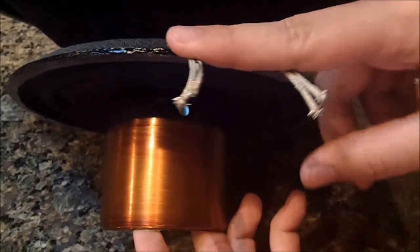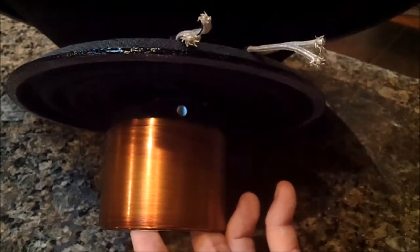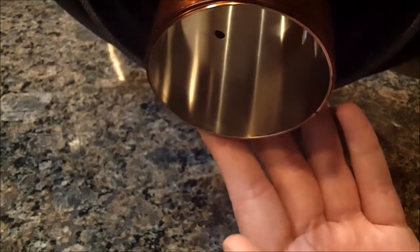Here's our triple progressive spiders. These are all stiff — you can get them with medium if you like. Moving over to the tinsel leads right here, you can see dual tinsel leads for each push terminal, sewn down on the spiders to prevent lead slap, which is really nice.